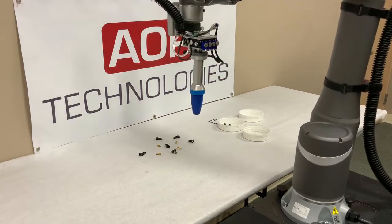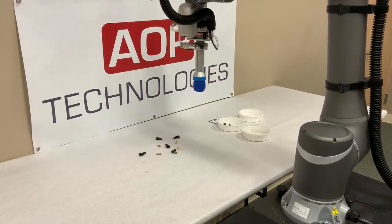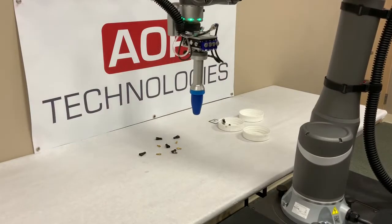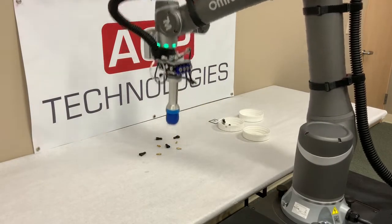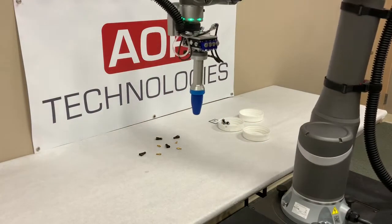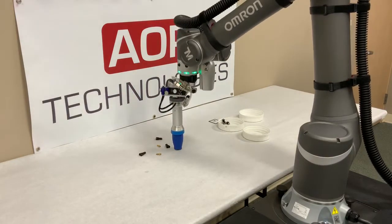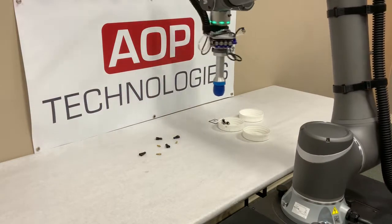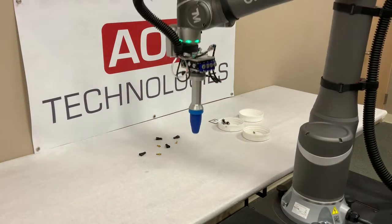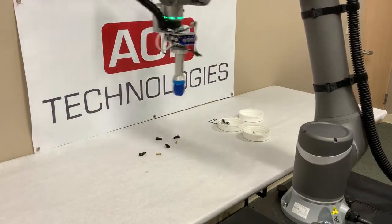The Adaptive Gripper is a very unique gripper. It's a conventional pneumatic cylinder with a bladder that is connected to the rod end of the cylinder at the tip of the bladder. As it comes down to pick up a part, the cylinder rod retracts and pulls the part inside the gripper. It's very good for picking up various different shapes of small products and working very close in conjunction with a human being because of the soft rubber nature of the gripper.